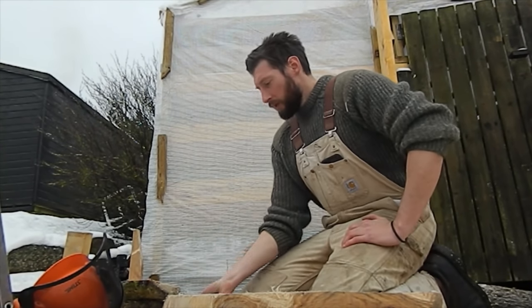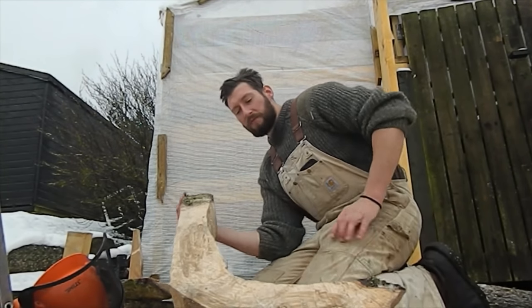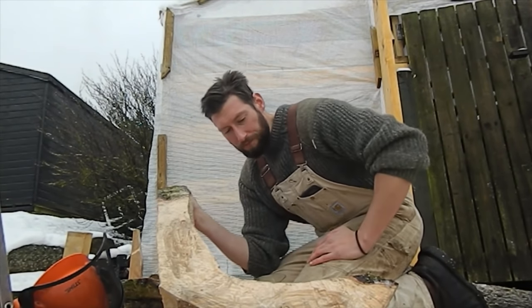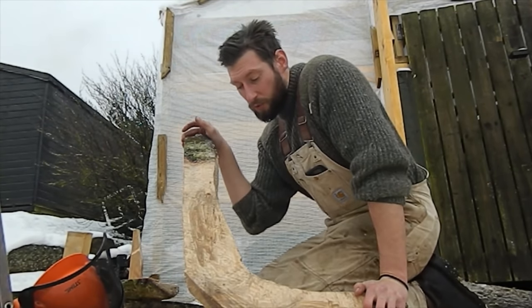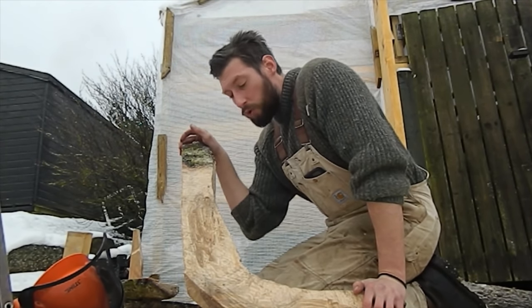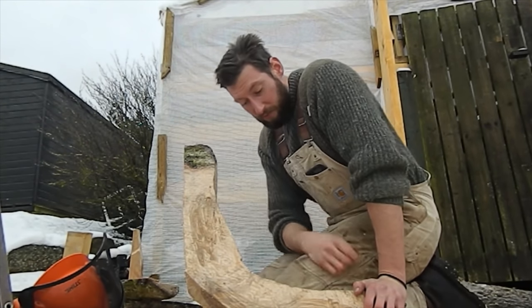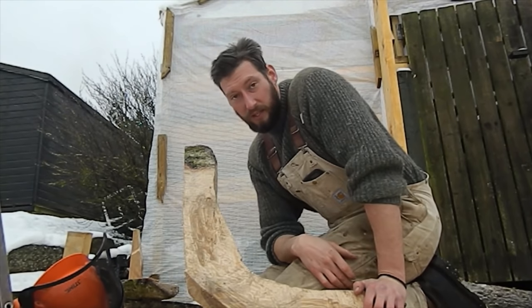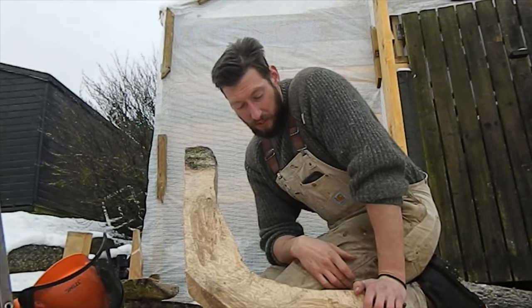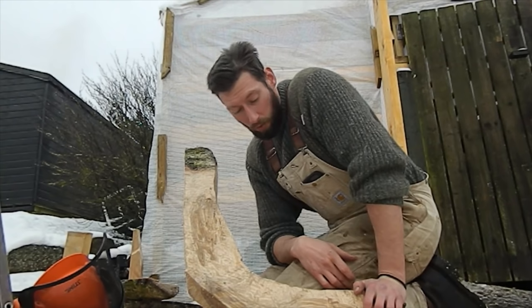So if I was to use this for a futtock of some sort, I'd have to be very careful, because you're going to get shrinkage in all planes. That may result in me having a piece of wood which was cut to the correct size and shape and fitted perfectly, no longer fitting perfectly. If we have a 10cm rib, 10% on that, we're going to be left with a 9cm rib, so that's a whole centimetre difference in what you had originally cut to size. So that results in a big hole in your boat.